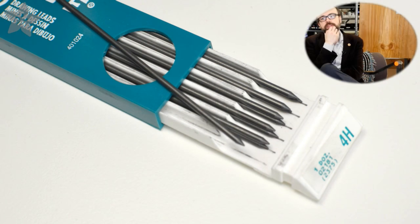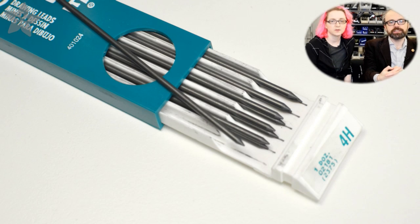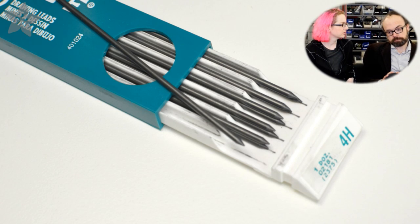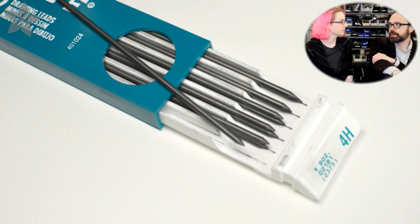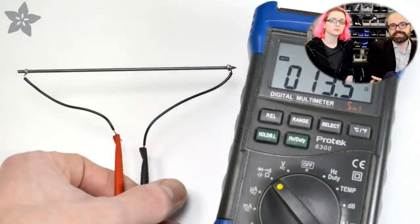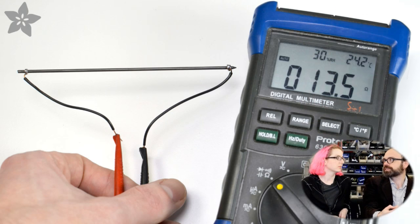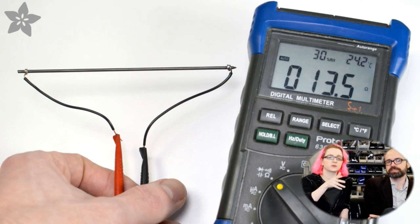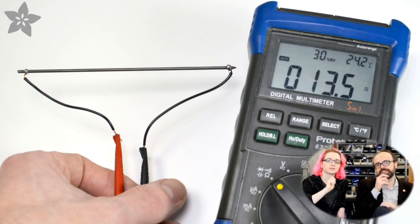A compressed graphite stick is good — those are the more silvery ones. The non-compressed ones just look like charcoal sticks. You were able to get about 1 to 10 kilohms, or up to 20 kilohms with one of those sheets. These are the graphite sticks I tried first — they were just single-digit ohms each. Too much graphite, tightly packed. Now, this usage — with two ends soldered — audiophiles actually use these as high-quality resistors in their amps. You can trim it. You can also draw on the other side to change the value.